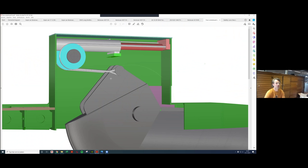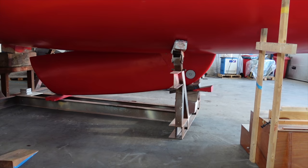In this case, all of the ballast is in this movable part. Yes, everything is in there. So this is aluminum? And then you cast lead inside the aluminum? Is that how it works? No, it's a steel case, and then we pour the lead in. We do steel because it's even stronger, and it's heavier, and that's the aim, to make it as heavy as possible.